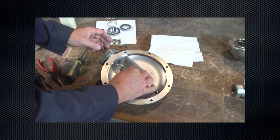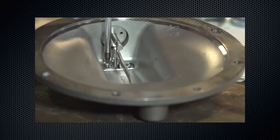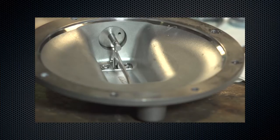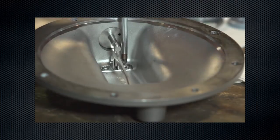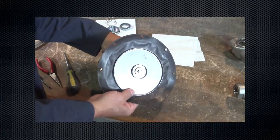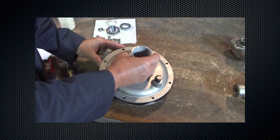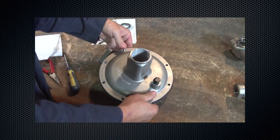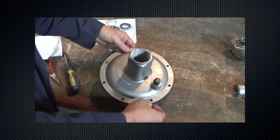Install the lever assembly into the stem and secure with machine screws. Install the pusher post and attached parts onto the lever. Install the spring case on the lower casing so that the vent assembly is correctly oriented, and using a 7/16 combination wrench, tighten the spring case cap screws and hex nuts in a criss-cross pattern to 90 to 126 inch pounds of torque.